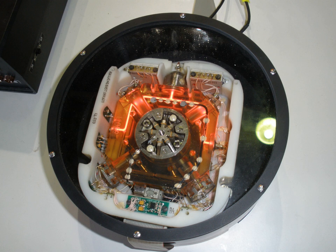Ring laser gyroscopes can be used as the stable elements for one degree of freedom each in an inertial reference system. The advantage of using an RLG is that there are no moving parts apart from the dither motor assembly and laser lock, compared to the conventional spinning gyroscope. This means there is no friction, which in turn means there will be no inherent drift terms.